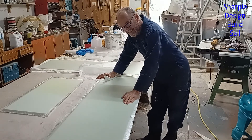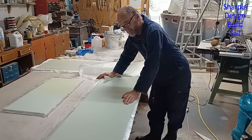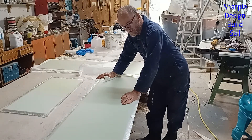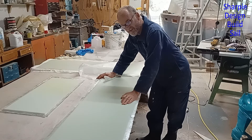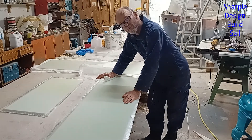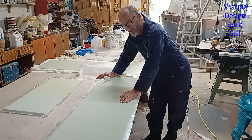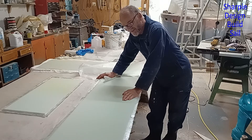The panel is coming out so nicely. I'm finally getting the knack of how to make them turn out really well, just with Peel Ply. Part of the secret is to really saturate the foam first. When I first started a lot of the glassing, I was probably not quite using enough resin, as I've mentioned before. By getting that full saturation into the foam before you put the fabric on — because it absorbs probably 50% more on the first layer of epoxy into this type of foam — getting enough resin on, putting the fabric on and really wetting it out.